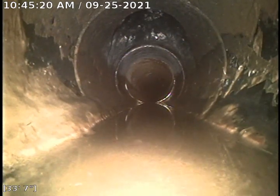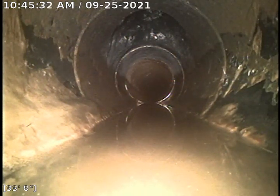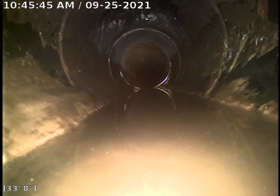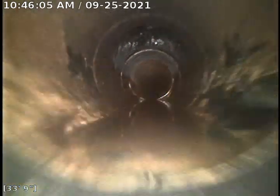This spot is just a hard turn to get past — it's stepped in. It seems that this line at 33 feet — 10, 20, 33 — is looks like it's outside the home most likely, and that's possibly where the clean out is. There's the three-inch ABS. Now we're going to pull back — we see we're going up — and that's pulling back up into the main line that's under the crawl space.